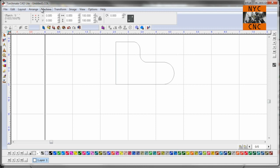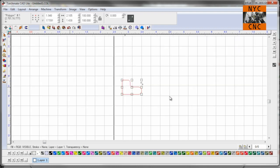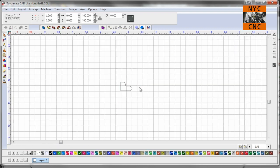I punch those out with my Whitney punch press. Cutting small circles is both inaccurate and a lot of taper, too. It's hard on piercing. It's hard on your plasma consumables. So I only cut the outside shape like so. So that's it. I guess it's not that bad, but as you tweak parts, it's a hassle to create a new drawing, export a new file, etc. But that's how it works.